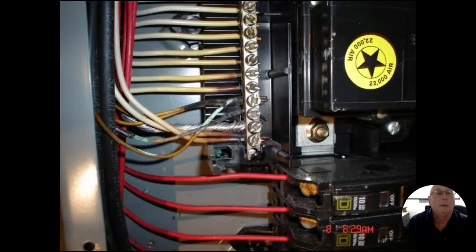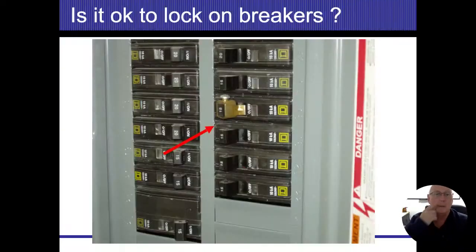All right, this one we saw earlier. Anytime I overload the neutrals, and it is possible to overload neutrals, if I'm sharing that neutral and they're both on the same phase, I can easily run too much electricity than what it's designed to carry. And also, if those wires are loose, they will create a series arc, and that arc will cause the insulation to melt and burn, just like this. So there's more than one reason, I guess, is where I'm going.